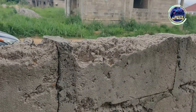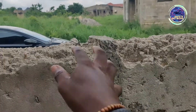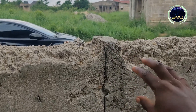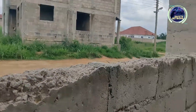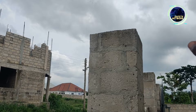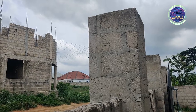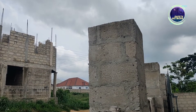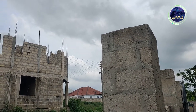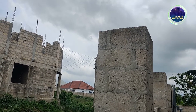We still need the carpenter to come and put the wood all around here so that they can pour the concrete into it and use it to make a cap. Then they will plaster and design it. The top over there — the carpenter has to board it around because this pillar is big, so there are no already fabricated caps that will fit it. It's like a customization, so the carpenter will do the design that is necessary. They will pour the mortar in and dress it out.